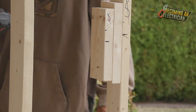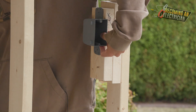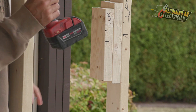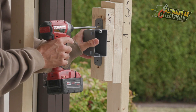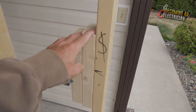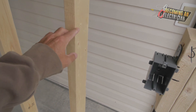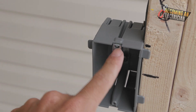The biggest thing with single-gang boxes is just making sure it is flush — not angled, not further out — because the box has tabs and it would make it hard on the drywaller. I'm going to go top of box and put the nail in the closest hole; it gives the tightest hold. There are two scabs installed — that is how you install them. In the next video we'll put in a single and double gang switch and show how we mount to the screw hole.